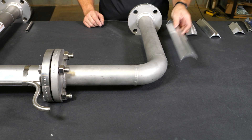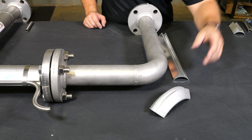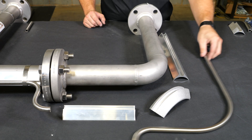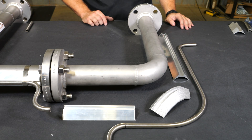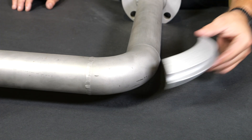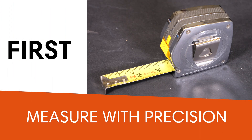Place the proper QMAX fittings at the location of each pipe fitting and the proper length of QMAX straight sections to match the length of piping. Now let's begin the application of the QMAX FTS in the following sequence. We start each circuit by positioning the first QMAX FTS elbow in the system. This elbow step is crucial to ensure system performance. Grab your trusty measuring tools and take accurate measurements of the straight section where your QMAX FTS will work its magic.